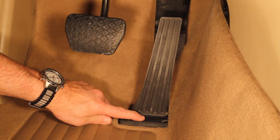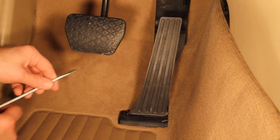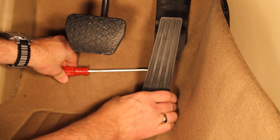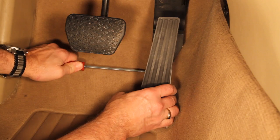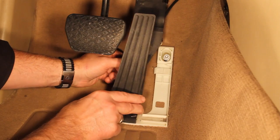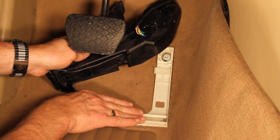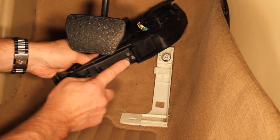Notice the smooth mounting plate at the base of the throttle and the securing clip on the side of the throttle housing. Insert a medium flat blade screwdriver into the securing clip access port. Twist the screwdriver to depress the clip downward. With the clip depressed, slide the throttle assembly to the left, removing it from the mounting bracket. Note the slide ribs and the securing clip on the mounting bracket, as well as the clip and slide receiver areas on the pedal assembly.